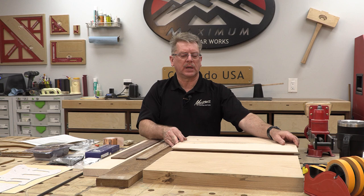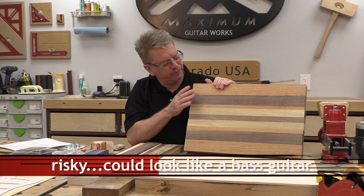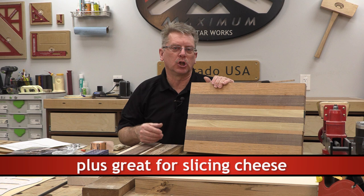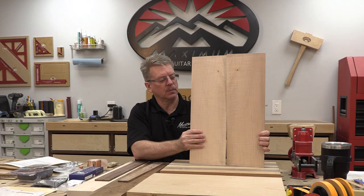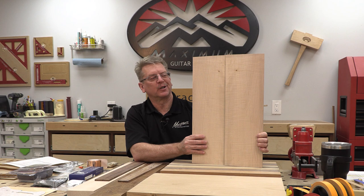Other options: you can use any wood you have available. I've been wanting to make a guitar out of leftover cutoffs of Honduran mahogany, black walnut, and some poplar from different bodies I've already glued up. You don't need a one-piece — you can have a two-piece alder body, a three-piece, or in this case a nine-piece body, and it's still going to build a very nice guitar. I'm going to use a bookmatch flame maple top to go on top of this butcher block body blank, because I think the front needs to be dressed up a little bit.